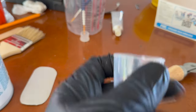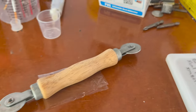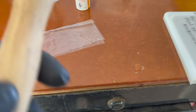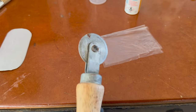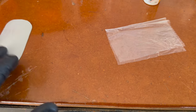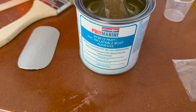I got a measuring cup. It's 25 to 1, so I'm doing 25 milliliters to 1 milliliter — which is so ridiculously small for Part B, the hardener. Also, once you put the patch on you want a roller. I have a screen door roller. Any kind of roller works to get out all the bubbles — put a lot of pressure. You can also use a fiberglass roller if you have one. Make sure you stir it up; even with two-part stuff, certain ingredients can settle.